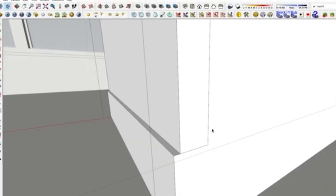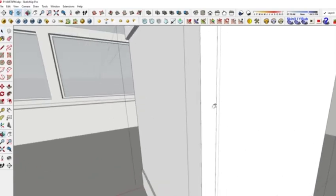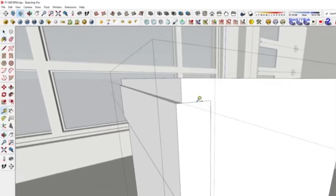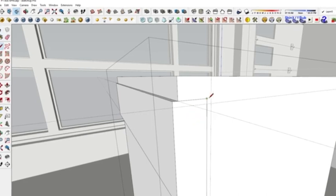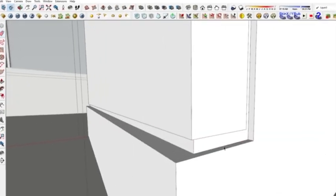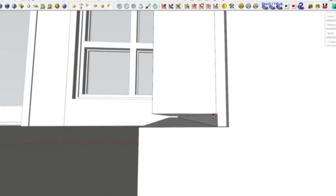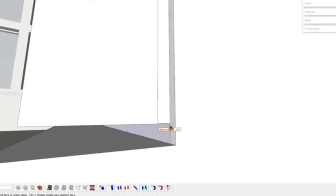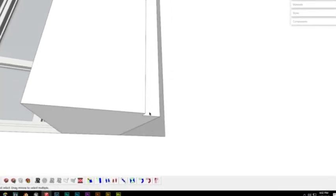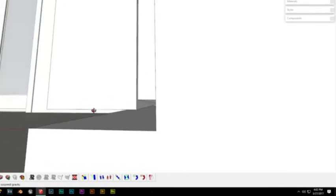Now we just have to find a bit of a gap here. I think we'll stick with 1/4 inch just for that weather stripping look that we had previously, and we'll actually pull it into the door on this side so we can keep that inch on top. And of course the underside isn't going to be stripped really, it's essentially where the hinge is going to be. So I can push that into there as well, and then I actually have to drag a line across here to there, and then bring this up 1/8 and clean up the back.